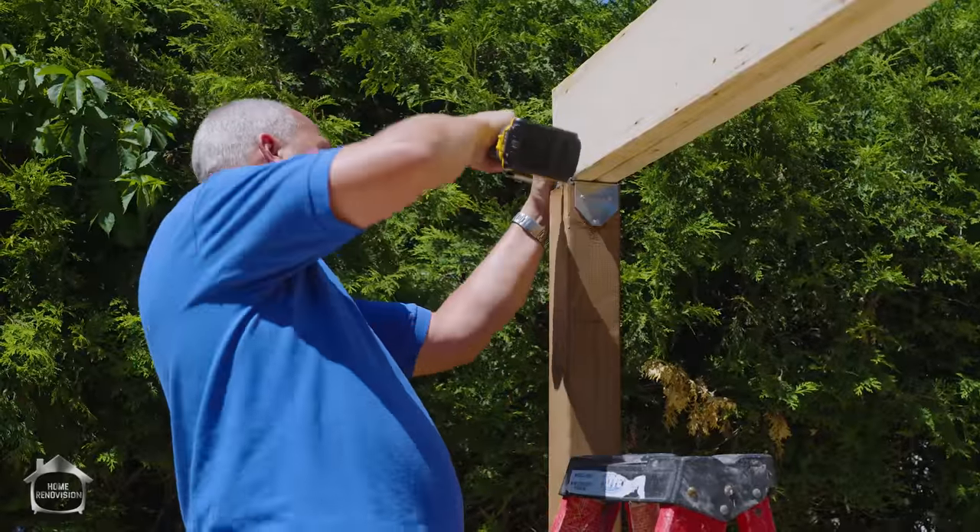My roof — I'm not looking for an overhang on the front. I'm going to make my roof square, put on my metal, then cap it with a piece of wood afterwards. I don't need an overhang, but if I wanted one, I'd take that angle, cut it off on a scratch board, and use that as a template to trace my angle anywhere I want on the board. Before I cut this, I'm going to grab my level and confirm these posts are sticking straight up — because this system only works if the posts are level.